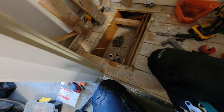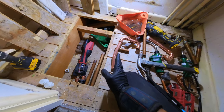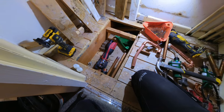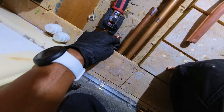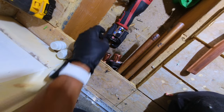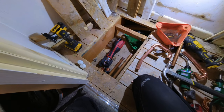So I've got my bits of pipe mocked up here — I'm going to link it out. It's going at a slight angle so I've had to put a bit of a kick on the pipes to loop them around. We are pressing but I can't get the jaws straight on there, so this is where my angle jaws are going to be making their maiden appearance. I put the sling over it from there — angle jaws will basically clamp on from the bottom and press that in place. I'll try to video it if I can.